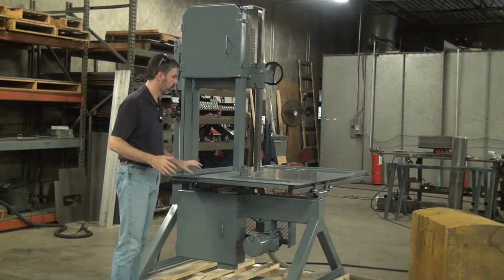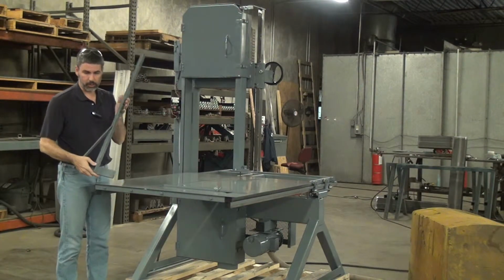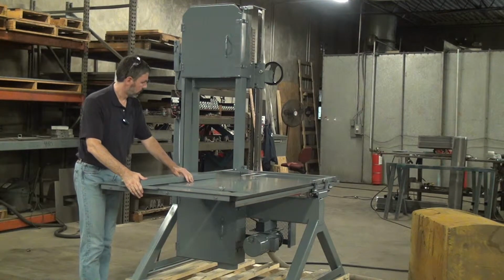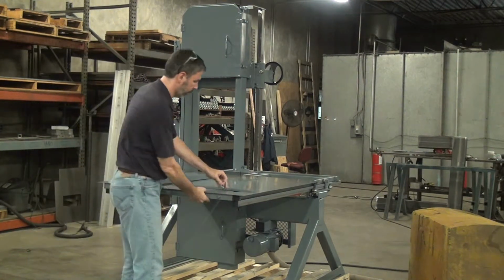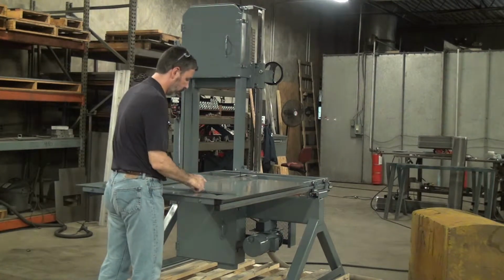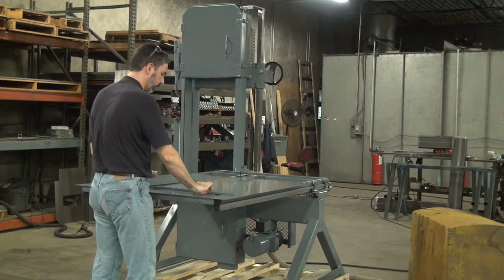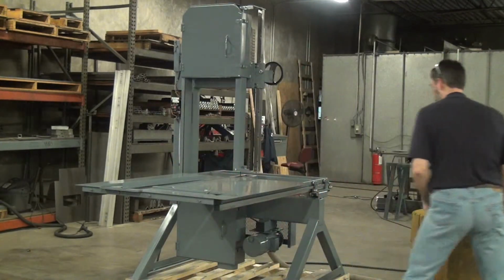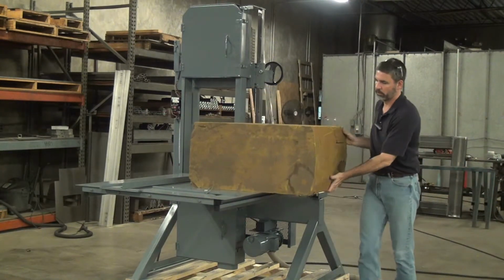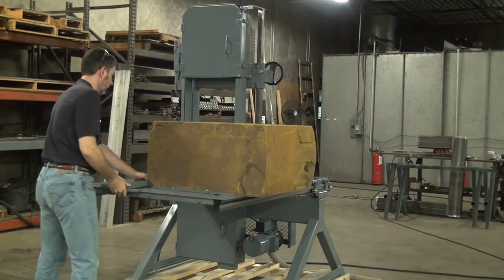Wouldn't be an introduction unless I was cutting something. So I've got just this big old block of foam to play with here. One of the standard pieces of the fittings fabrication kit is what we call a T-square. Set it up as a work stop. Basically, it's a simple rip fence to use as a backstop for fitting. The miter bar here, for my insulation customers, can swing and preset the angle for mitered elbows. For what I'm doing here, I'm going to set the pin at 0 degrees, and I've got myself a framing square. So I can place my workpiece up on the table, press it up against the effectively framing square, and the stop, and get a repeatable cut.